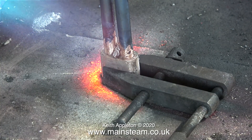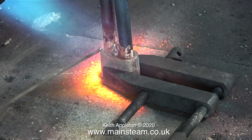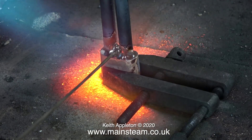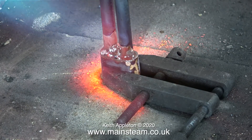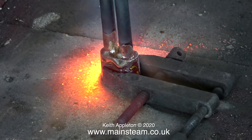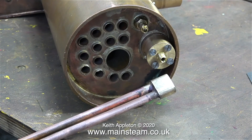Usually when I show the silver soldering process I apply the silver solder far too early. Is this because I'm stupid and incompetent? No. I generally do it this way for the videos because I get a lot of communications from viewers asking why they can't silver solder and why the silver solder just stays in blobs on top of the work. There are a combination of answers: dirty contaminated metal, insufficient flux, and more commonly insufficient heat. I'm purposely applying a lot of silver solder on this joint and I'll clean it up shortly. If this superheater got so hot as to melt the silver solder — and I don't think that's ever going to happen — as the copper is threaded into the block, the block will not blow off the end of the pipes.